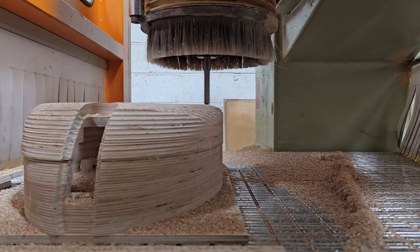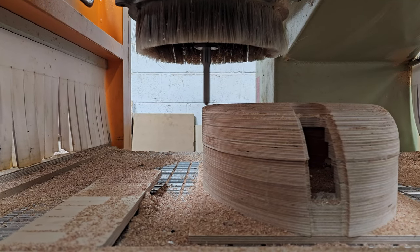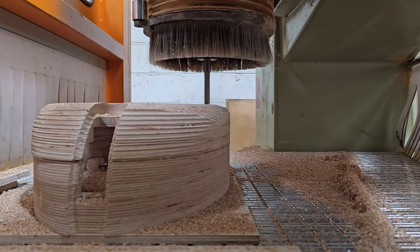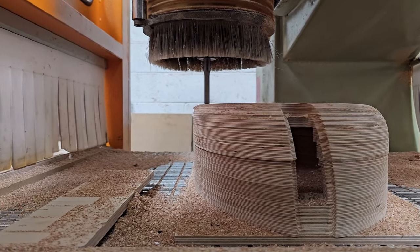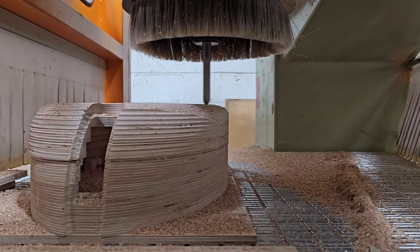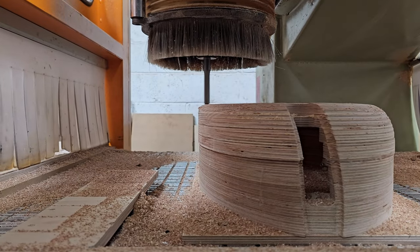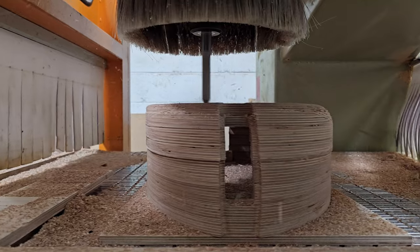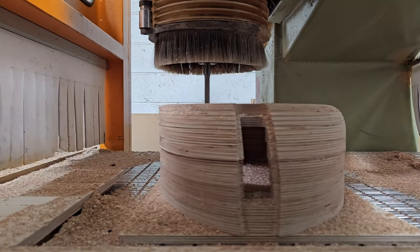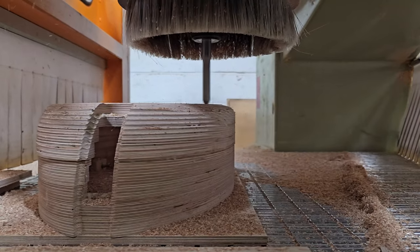You can see the stripes are quite close together towards the bottom. But as the angle increases towards the top there, those stripes get wider and wider apart, and there's a really constant kind of striped profile around the front, particularly on that top front face that we said we can't quite see here. Now, if I start sanding that a lot to remove all the ridges that are left by the cutter, I quite quickly change how those stripes are shown. So I decided it was best to really take my time, and that's why this bit seems to be cutting in the same place over and over again, to get them really close together.